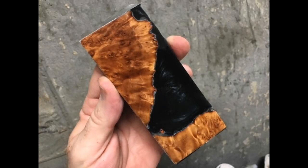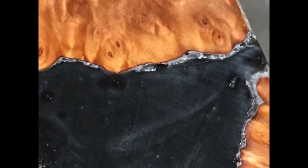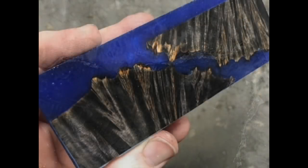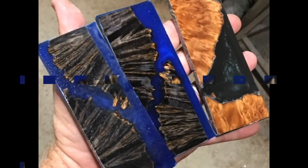I was told by one of the other knife makers on the Knives and Knife Making Forum that I could have eliminated these bubbles if I had heated up the stabilized wood, either by keeping it in a boiler room or throwing it in an oven and bringing it up to 100 or 110 degrees before casting. Bottom line: I was very happy with the blue, not so much with the black. I hope you enjoyed the video — please give it a thumbs up and subscribe. If you're interested in knife making, check us out on Facebook at the Knives and Knife Making group. Thank you very much.